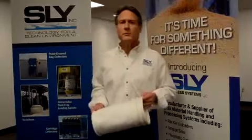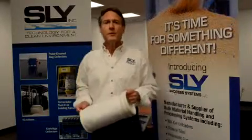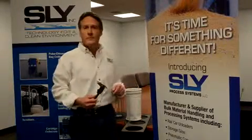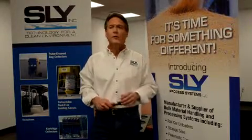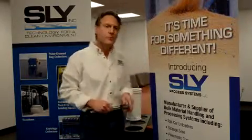When purchasing replacement filter bags — preferably from Sly — be sure to precisely measure the tube sheet hole in your dust collector with a pair of calipers. Advise your supplier with this information, as the groove is sized to provide a tight fit with your tube sheet. Even as little as 20 thousandths of an inch in either direction can determine whether you get a proper seal.